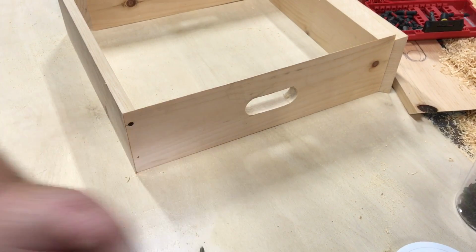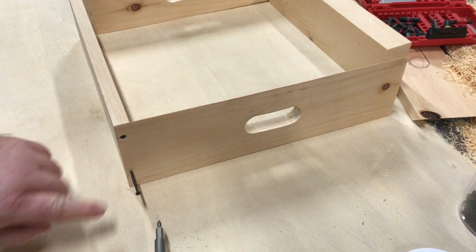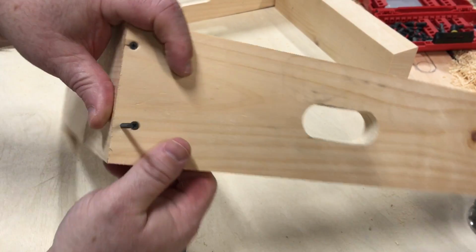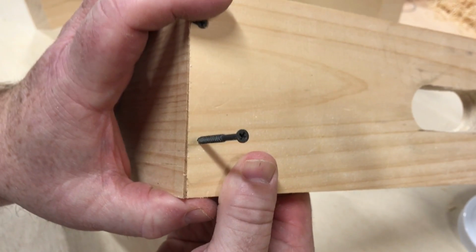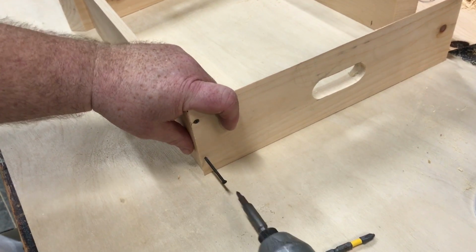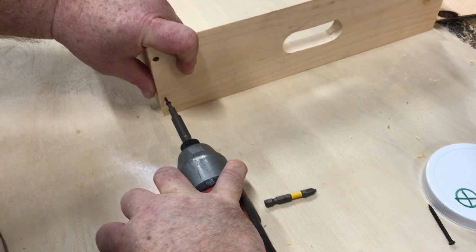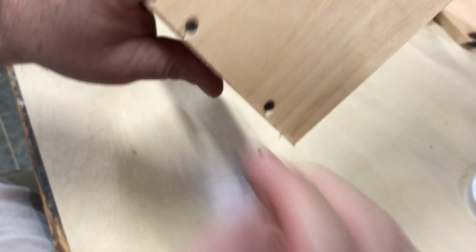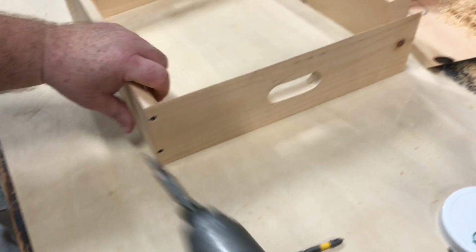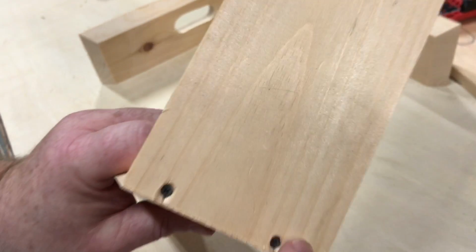You want that set up a little bit so we can put wood filler over it. You want the edge that you're driving in to lap over this just a little bit, right? So you can sand it? No, so when this screw pulls up, can you see the edges? Mm-hmm. If I leave it where it is now, when I screw it, it's going to go in like that, okay? So what you want to do is pull it out a little bit first, and then run the screw in until it's flush. I'm having a hard time getting a bite on this. See how it moved in? Yeah, for sure. Now we can sand that, but I could have started it out even farther and it would have been more flush. What I'm going to do is make this one the same, and when we sand it, see that, we'll knock that edge off right there.